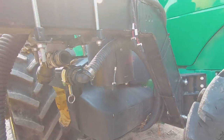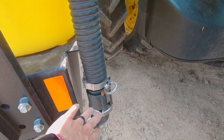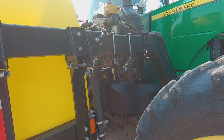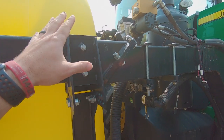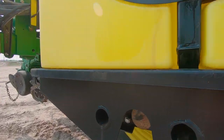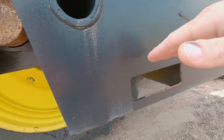Just kids having fun. They go all in underneath to the planter right here. Nice thing is we got them so you just quick clamp them off. So it shouldn't be too bad. Then take the tanks off. They unbolt right here. They pop off. And then there's a fitting underneath that you lift up on. You basically unbolt these. There's four bolts there. You got forklift holes. You'll basically go straight up with it. And they should, in theory, pop off that way.